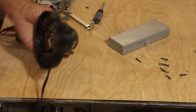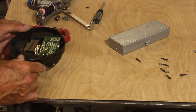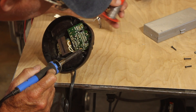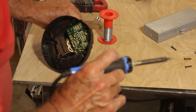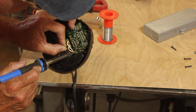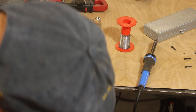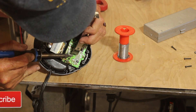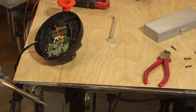I've got 15 volts there, so somewhere between there and these little pins we're losing our voltage. There's a whole lot of circuitry in there, but one thing I think we can do is just jump from that bridge rectifier straight to the connector pins. The voltage is a little high at 15 volts so I'm going to put a resistor in there to drop it. I did the calculation based on my best guess of how much current this drew and it should have been a 6,000 ohm resistor, but I don't have one so I'm using two 3,000 ohm resistors. Now one thing about electrical circuits is they will take the path of least resistance, so if I jump from my DC output right to my contact pins it is going to just bypass all that circuitry.